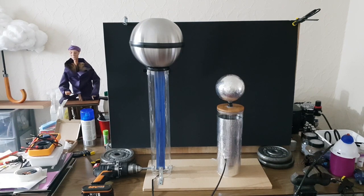The Van de Graaff generator I built earlier in the year, but only the other week I built this Leyden jar. It's quite good for using the Van de Graaff generator on days like today where it's particularly humid and you can't get any decent spark off it. What I've been doing is charging the Leyden jar, letting the charge build up for a bit, and then when it discharges you get much healthier sparks than you do straight from the Van de Graaff generator.